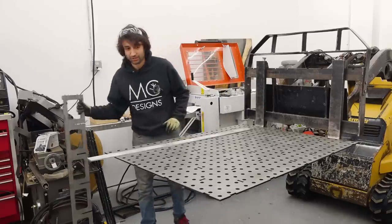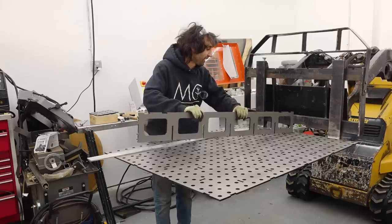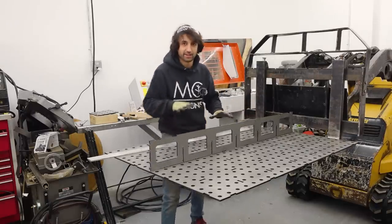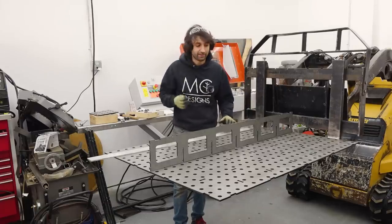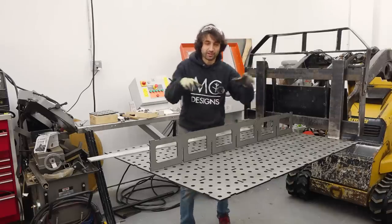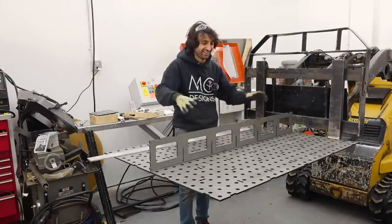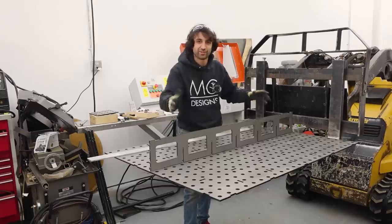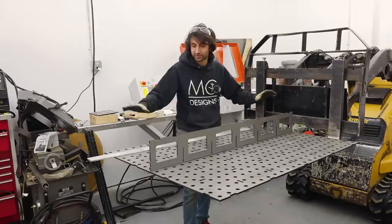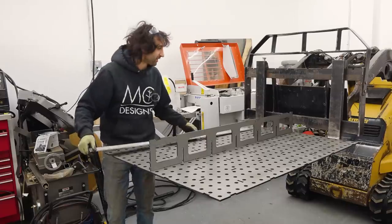One thing I already did was check the skin to see if it has any natural inclination for dishing. Currently it's kind of cupped. I have it oriented so the bowl of the cup faces up — when we suck the center in, the outsides will pull tight. That's supposed to be easier than trying to force the outside perimeter down to the ribs.